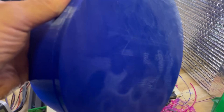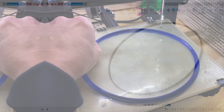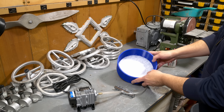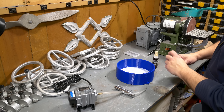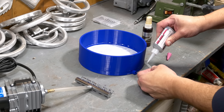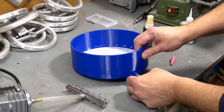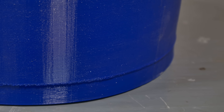We're going to use a coffee filter in the bottom to prevent the powder from filling up the lower chamber, so I need to create a ring to hold the filter in place. This is our 3D printed part and I've got the filter in there too. I need to try to glue this tubing in — I don't expect it'll stick, but I'm hoping it closes up the gap a little bit. You can see signs that even with the PLA, the top of the chamber area pulled in a little bit and created a visible line on the outside of the print, but not enough to cause the print to fail.